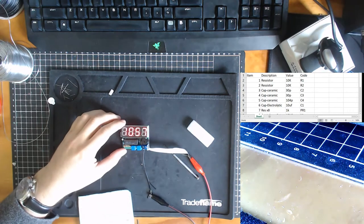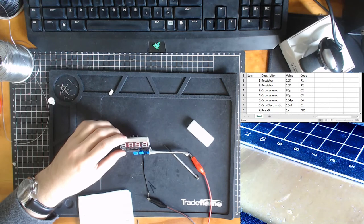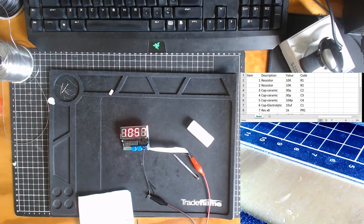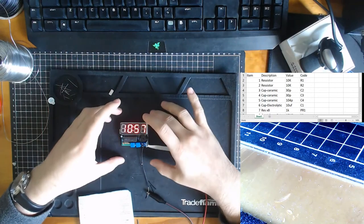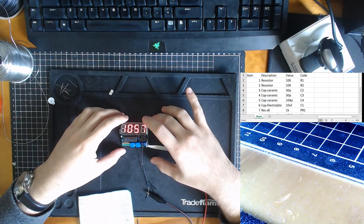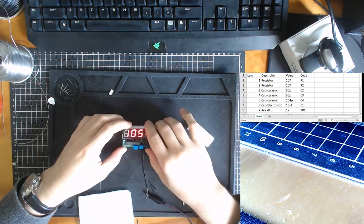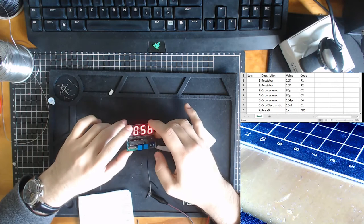Will this work under 3 volts? It's very dull at 3 volts. 5 volts is an annoying voltage. Is that 3 batteries? That's 4.5 volts, possibly. I could just get 9 volts and throw a resistor in there, but it's going to get hot. I could get a little buck converter. The point is, I'll get something to plug 5 volts into this battery pack, and then I'll have a portable clock that can work, and that's not the worst thing. In fact, I might even laser cut the instructions on the back, so any person who sees this can know what to do with it.